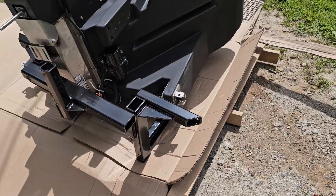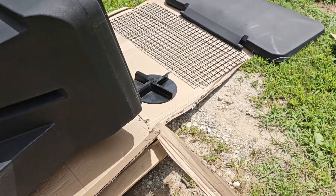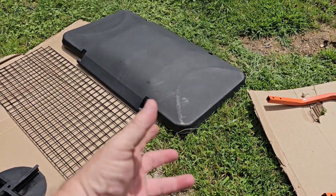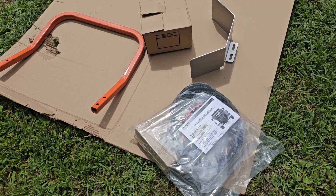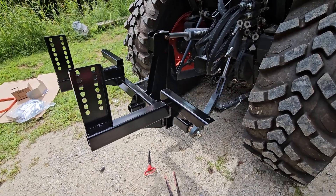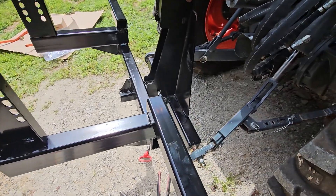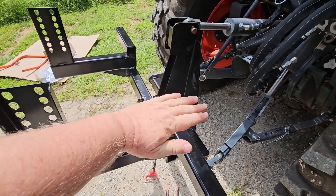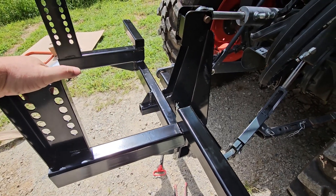The box is being cut open. Got the bracket that's going to go into the hitch, the spreader, spinner, lid — I love that the lid is pretty light but seems very durable. The protector bar, shield, harness, all the wiring is all here. So we've got the three-point receiver on the tractor and the main holding bracket for the salt spreader. There's actually not a lot of slop, but that'll get taken up. Depending on how this works with what I build to stabilize it, I may even add a shim in there just to keep this all snug and tight.